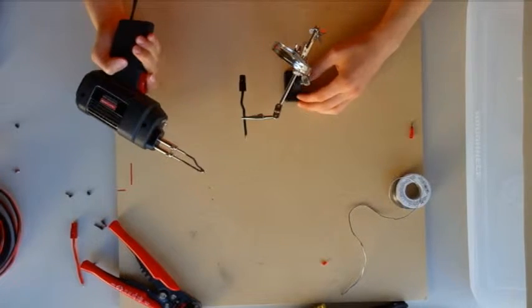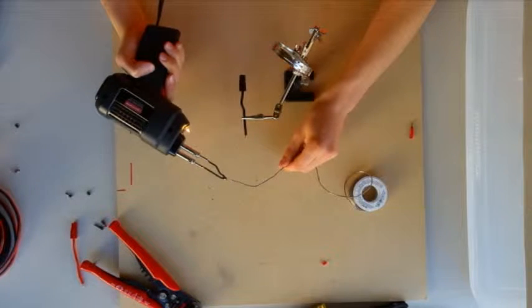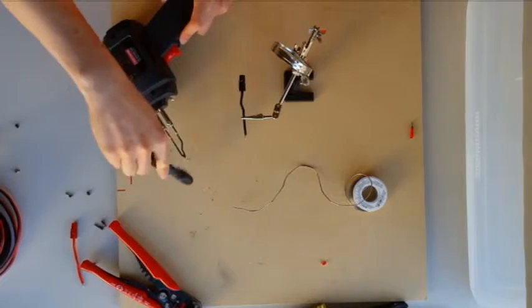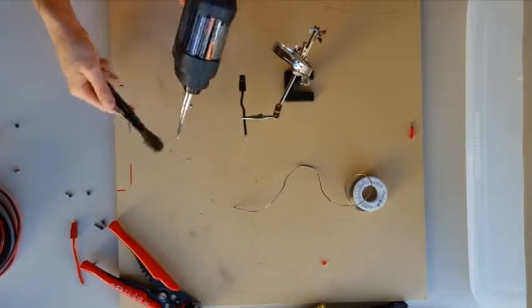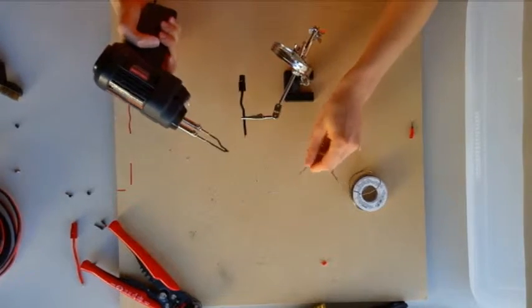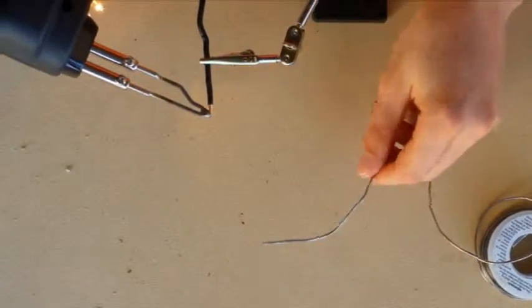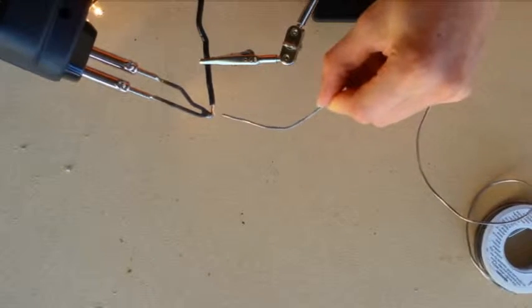So I got my soldering gun here. Usually what we do before we solder is just bring the solder to it a little bit just to get a small amount of solder into the gun. Just a little bit — you don't need a whole lot. You can get all the extra stuff off with the brass brush. When you have your soldering gun, you want to first heat up the wire for about 10 seconds, making sure it's towards the tip of the wire, not towards the plastic. Then bring the solder in, move the solder around, remove the solder first, and then the gun.